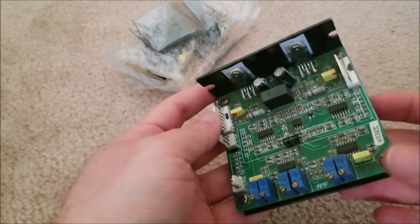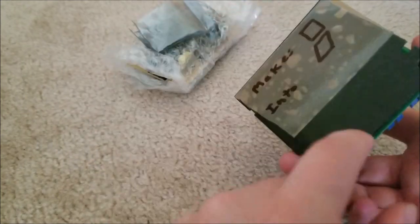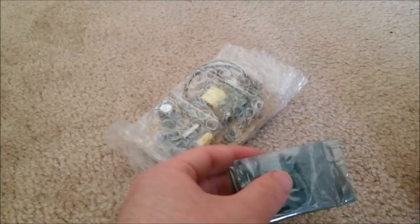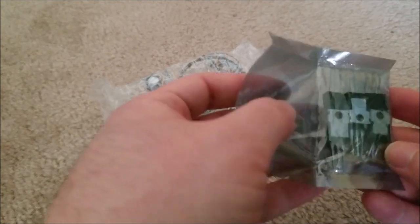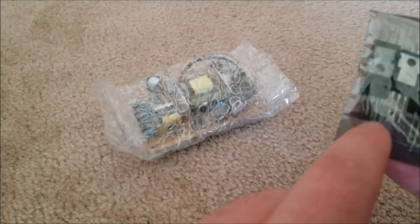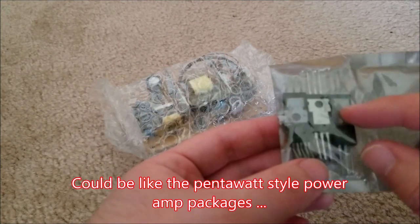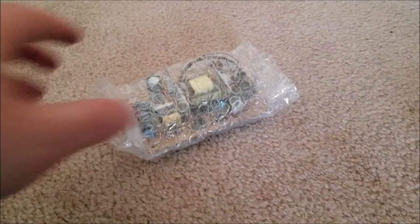We have another board — this looks like it has both X and Y Galvo drivers. It has a nice little aluminum base. We'll definitely play around with this. I have so many different toys to play around with — between this, the PS3s I received recently, and the Discman to repair. These look like TO-220 package devices. The ones with five leads are probably op-amps of some sort, and the three-lead ones are probably FETs that actually drive the coils. So yeah, definitely kudos on that — I have some spares.